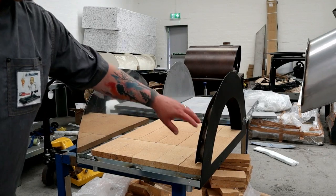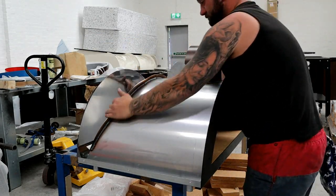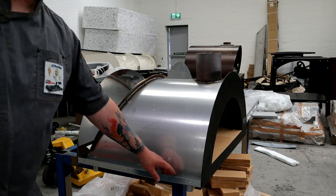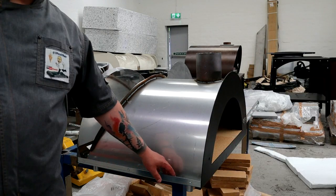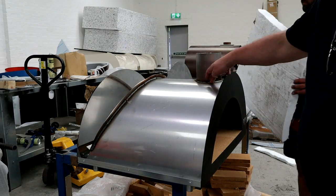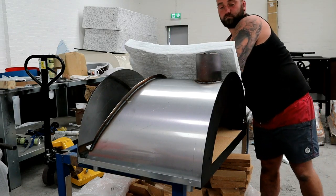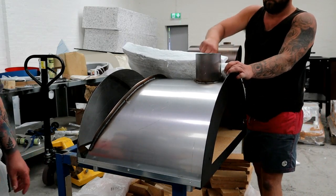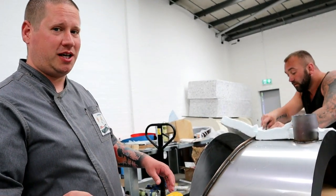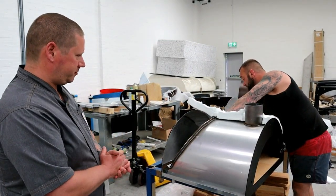This one's got the back on, it's got the front on, and it's getting the internal oven going now. Normally it'll be riveted, but they're going to show us putting some insulation on — to show the detail of the fully welded oven and the insulation we're putting in. If you see the unboxing video of the Vesta, you'll see at the end — after it had been on about three hours — I was able to put my hand on it, it was warm but not a burn. Just so you can see.